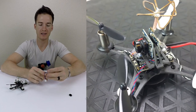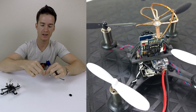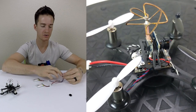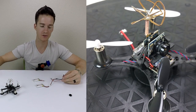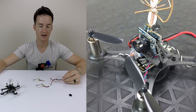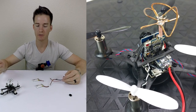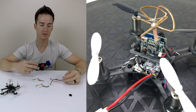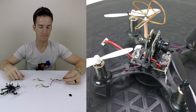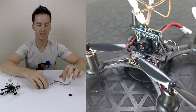The charging cable. Oh my goodness, I spent so much time trying to make this work. So basically, the concept is you take battery A, battery B, you plug them in, now you have basically a 2-cell LiPo battery that you can charge through a balance plug. That's logical. I have a pretty decent quality LiPo charger, and I've got some crummy LiPo chargers. None of them could charge these batteries through a balance plug without the power plug. Usually on the bigger LiPo batteries, you've got two discharging cables coming out, your positive and negative, then you've got your charge balance plug that meters how much each cell actually has so it can figure out how to charge them. And without the normal power plug coming out in addition to the balance charge, the chargers wouldn't charge it. So I had to basically make my own adapter.